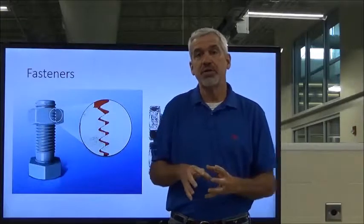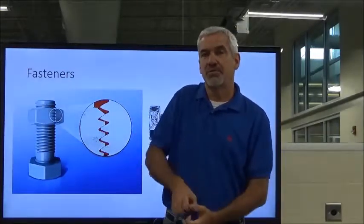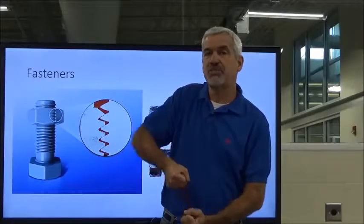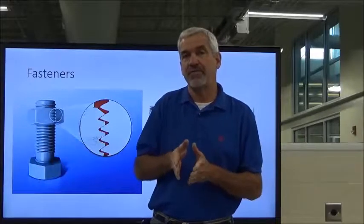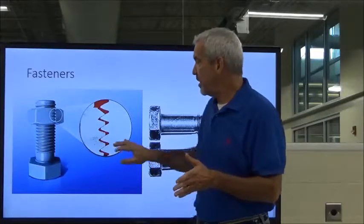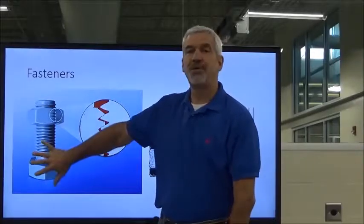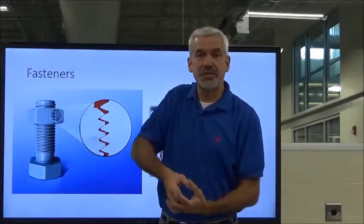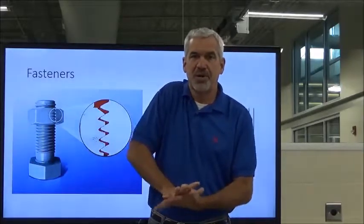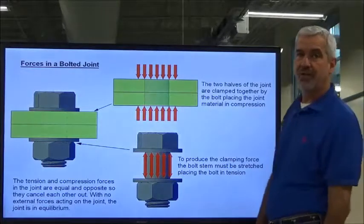You can overdo it when you tighten the bolt. Most of the time people think you kind of twist it off, but what you've done is applied too much tensile strength and it breaks the bolt. What we're trying to do is apply enough torque to the nut so that we apply the proper amount of tensile strength that the bolt is rated for. We don't want to under-apply because we don't get the stretching and we don't get the compression force we're looking for against the two pieces of material we're assembling.